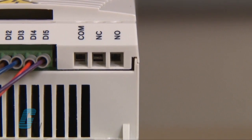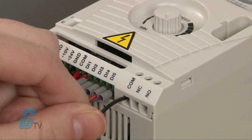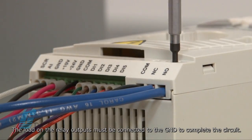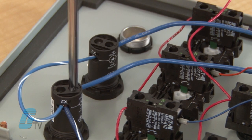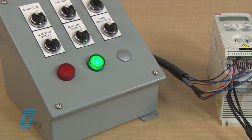For my last three IOs, I will remove the drive from the power and take a closer look. These are for my relay outputs. I can use a pilot light to simulate a fault or stable indication. This will use the power supplied from the 24-volt output by jumping this to the common, and then I can wire the normally open or normally closed connection. I can use two pilot lights with a green light on the normally closed and a red light on the normally open connection. When a fault occurs, the contacts would change state and go from green to red.